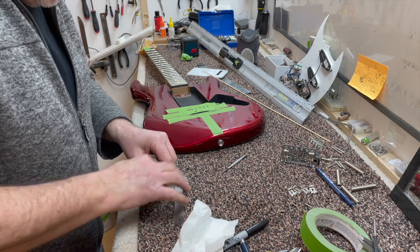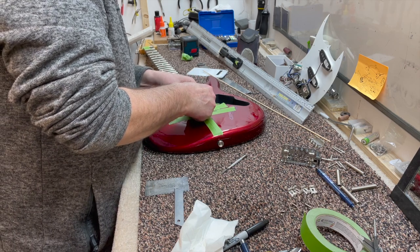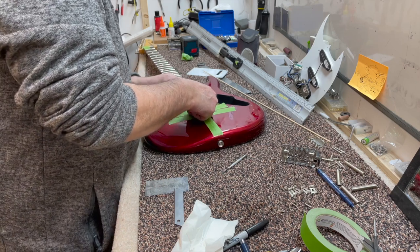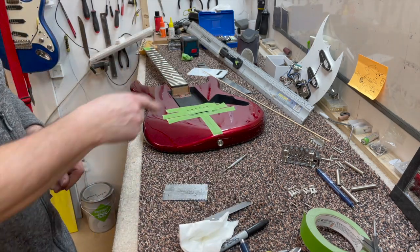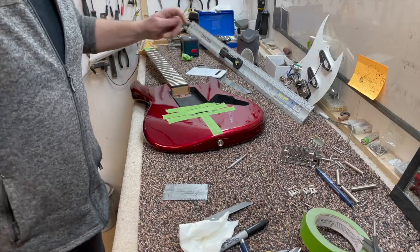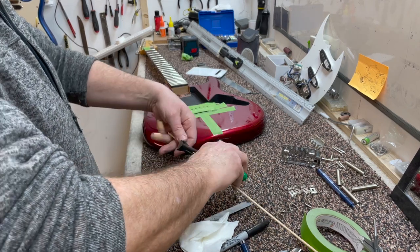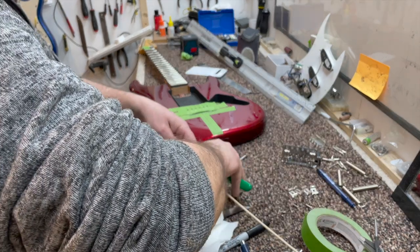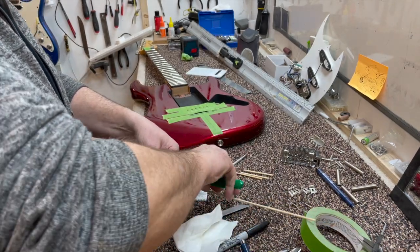Okay, so what I'll use is I'll get some clear two-pack varnish. No, resin is the word I'm looking for. It'll be a sort of 20-minute, half an hour setting, and I will use that to fill out, pack out this dowel, which is not wide enough, but we don't really have a lot of choice because the holes are a bit ragged and big. And they're actually slightly varying sizes, which is even more perplexing. So I'll just get six of my little filler bits.